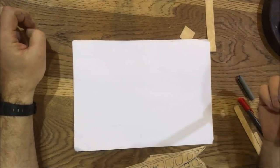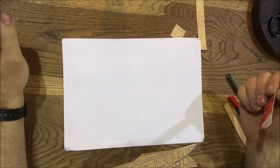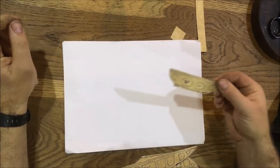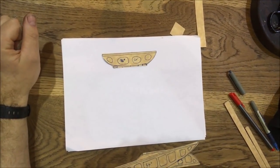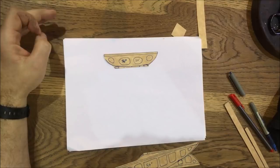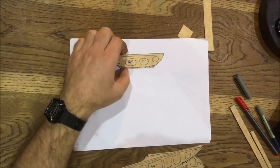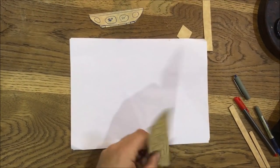Well, we lost a load of footage from the start of the scraping in the 54-inch. Not all of it, so I'm going to do a bit of an explanation with some visual aids. So you'll remember I did a 24-inch. I had a 24-inch straight edge, which is good. It prints repeatably all over my 24x18 surface plate. So I know I've got one good surface plate, surface straight edge.